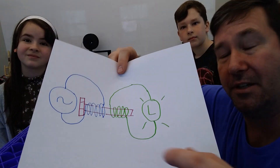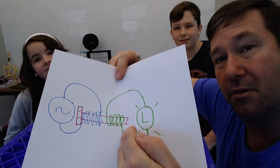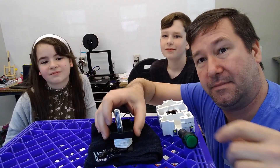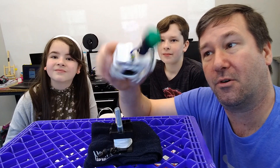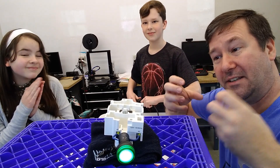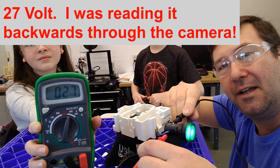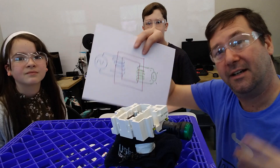Now it's not going to work perfectly, and that's probably fine — the magnetic flux is not going to be perfectly transferred because we're using a 120 volt coil on each side. So if we put 120 volts in, we should theoretically get 120 out, but we're not going to. When we plug in our 120 volts, we get the light, and you'll also hear that humming. That humming is actually coming from the bolt vibrating in the magnetic field. So while we have 120 volt wall power, when we plug it in, we only have about 57 volts actually making it to the light. That's why you have the steel core piece going all the way around in a real transformer — to help increase efficiency.